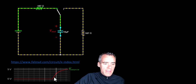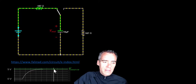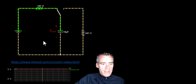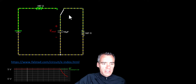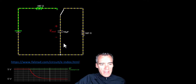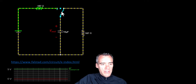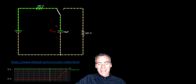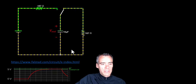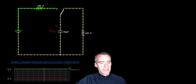When I flip the switch, you can see current flowing and the voltage across our capacitor is rising until after a few milliseconds it matches the voltage of our source. Then if I flip the switch again, the current dissipates through this resistor until it runs out of charge and there's no voltage across the capacitor anymore. So it charges up — kind of like a battery — until it's full, then no current. Flip the switch and it discharges.